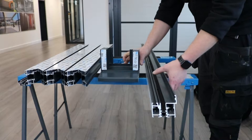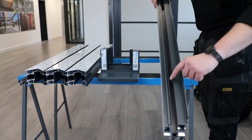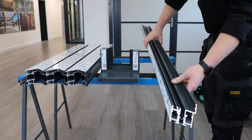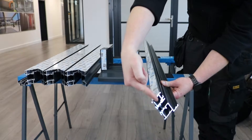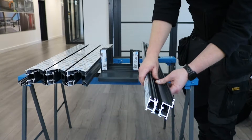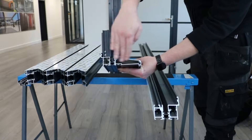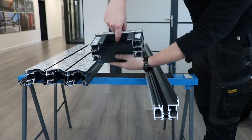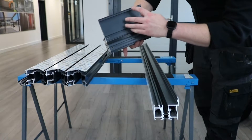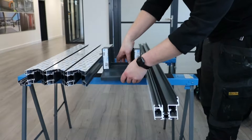There are many different threshold options for the bifold. The standard threshold can be drained for concealed drainage with 8mm holes all the way through the thermal break, or it can be face drained with a 5mm slot through the two skins of the face and one skin through the thermal. We also do an integrated sill which is pre-drained on the inside, and then all we need to do is drill 5mm holes in the nose of the sill for the drainage. We also do a low rise threshold and internal door threshold options.